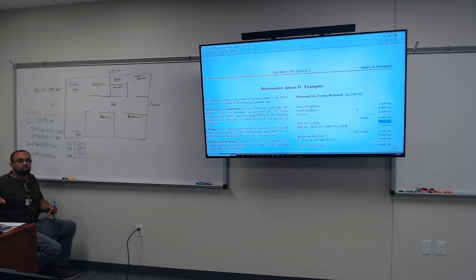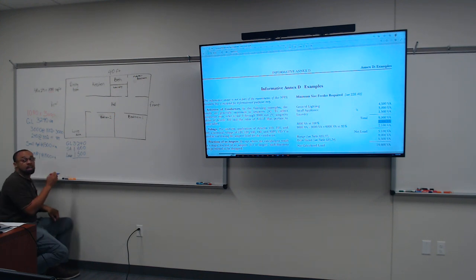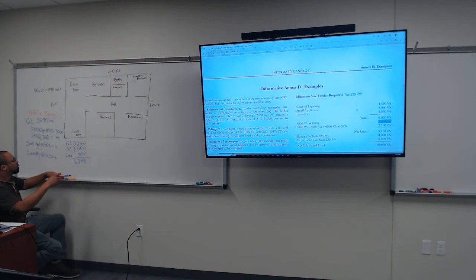Are we using 3,240? We're adding all of these, and then we're gonna apply the demand factors. But we're using 3,240 plus 1,500, so that's what? 3,000, that's gonna be what? 4,740. Oh, my bad. So this is 3,000. 3,000 plus 3,240, 6,240. So what about the whole 3,000 at 100%? And yeah, we're going to apply that. Yeah, that's what I said. When I did that, I was jumping the gun. I see. Yeah, I was jumping the gun.